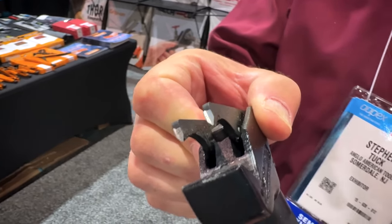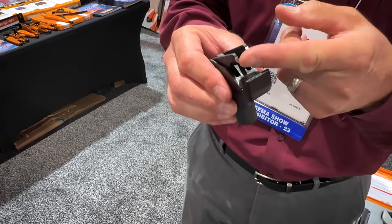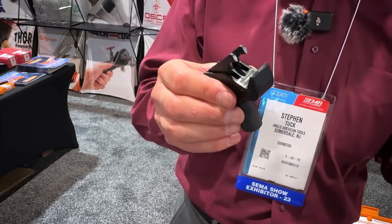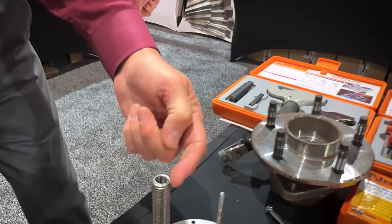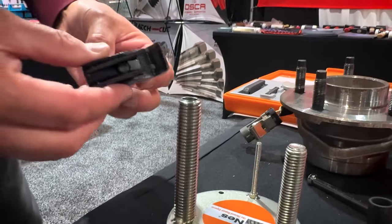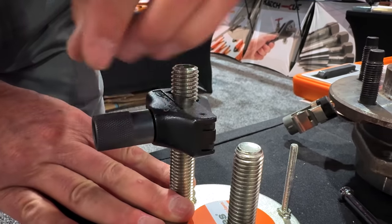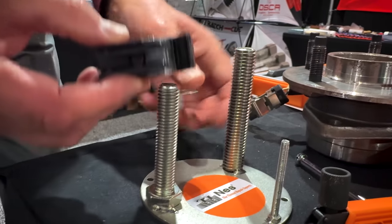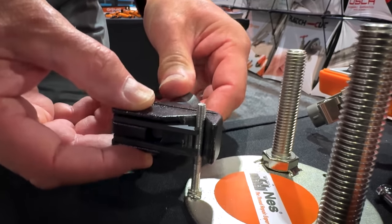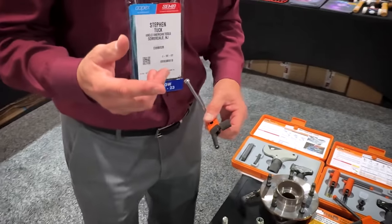The cutters lightly float so they'll adapt to any pitch — right-handed or left-handed. The cutters are high-speed steel, induction hardened to 58 Rockwell, so they're going to last a few hundred times, but they are replaceable — just punch out the roll pin, put in a new set of blades, and put the roll pin back in. For a damaged thread that's mushroomed at the beginning where you can't get a die on there, you open it up, close it onto the good threads, and those two cutters automatically find the good threads. As you chase it around, wherever the damaged thread is, the cutter just cuts right through. The Nest 1A goes from 5/16ths to 3/4 inch, or 4 to 19 millimeters.